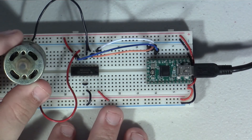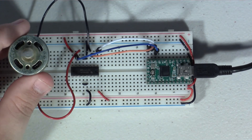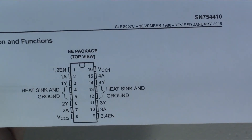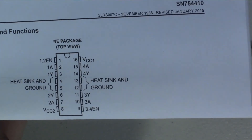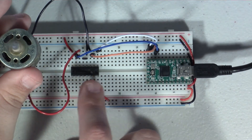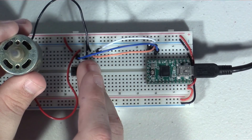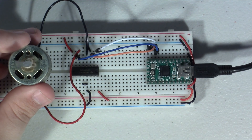This is the basic but very effective way to wire up one of these H-bridges for bi-directional motor control. If you wanted to set up a second motor, it's basically the same thing — you have pins 3A, 4A, and the 3-4EN enable pin connecting to three more Arduino pins, and then 3Y and 4Y connect to your second motor. It's not too hard to get a second motor running off the same chip.